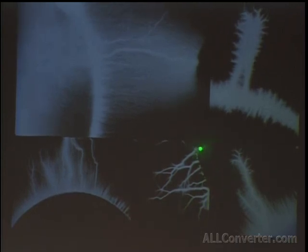These are some effects that I've photographed that can be done with these types of coils. To the left, you see the effluves created from just a single wire. And to the right, you see a halo effect. What's interesting with these early make and break type systems is that you get spark discharges that are a little bit different than what you normally see. They tend to be branching. They tend to be defined a little bit differently than what we think of as a normal spark.